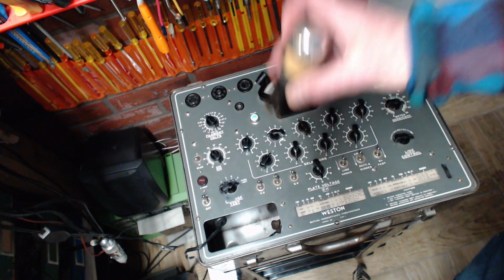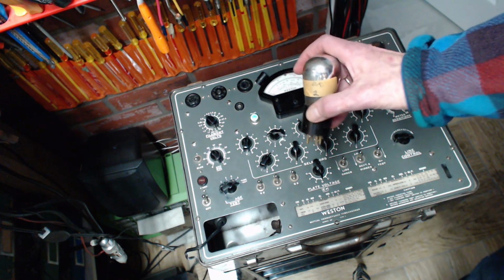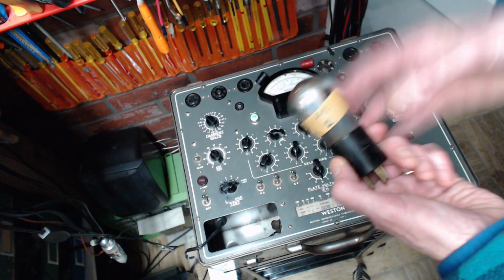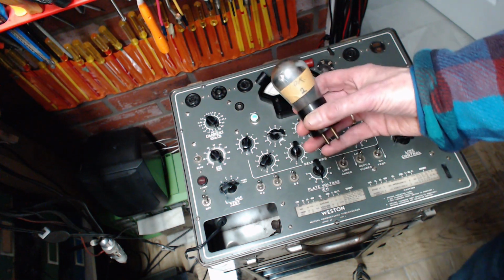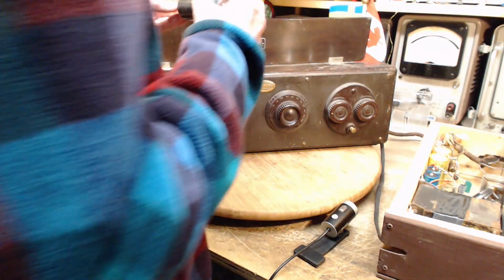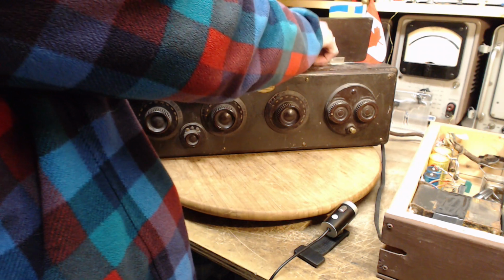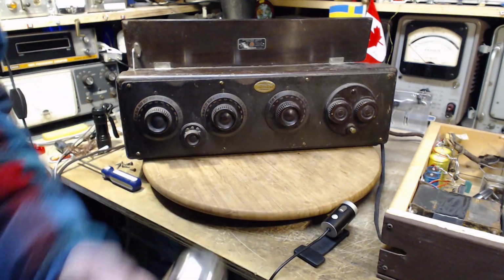So one solution is just plug the tube in and operate it for a period of time. Well, if that's the solution, then there really isn't a solution, is there? Because you just plug it in and operate it. But over time, there might be some ions in there, and you might get grid current, maybe. I don't know, and maybe the stuff flushes out after a little bit of time. I don't really know what I'm talking about, but nothing new in that. You know, if you wait until you know everything, you won't get anything done ever. And us human beings, we're really good at taking partial and conflicting information and sorting through it. We're really, really good at it. 201A. Let's go with another one.